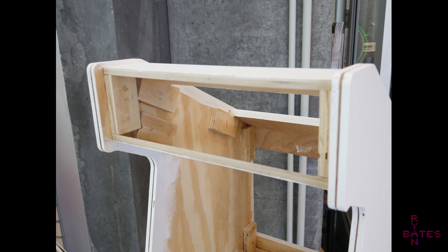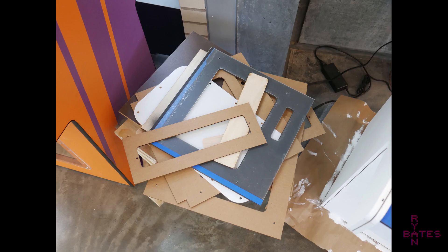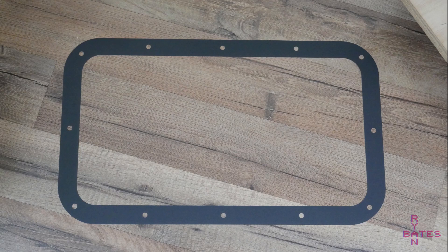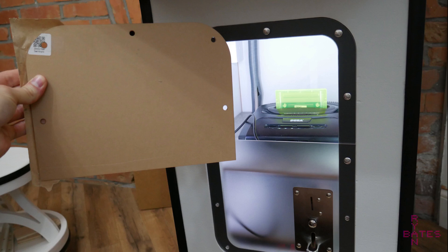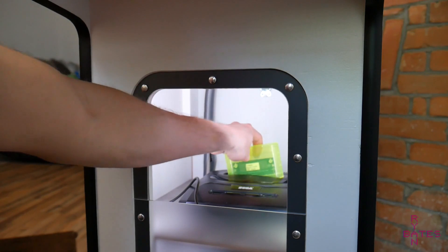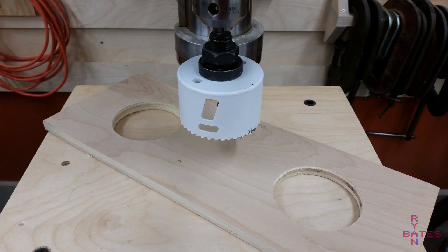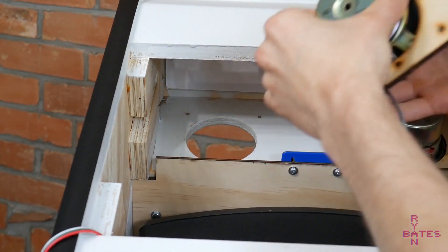The marquee cutout panel also had to be done, and at that point the arcade cabinet wasn't square at the top, so I had to cut an out-of-square piece — a couple of cardboard test fits and it's glued on and done. The port hole is laser cut from acrylic and also supports the coin slot, with a black matte poster board border to accentuate the edge. There's also a full blocked version for public use. The speaker panel uses a hole saw to cut two holes for three-inch speakers. The rear panel required a large cutout because the tube TV body is long, and has two fan cutouts for active cooling.